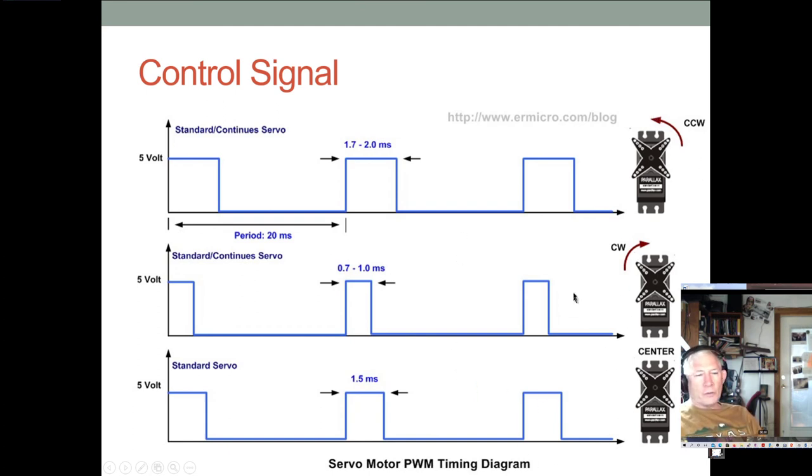You need to look at how your servo's moving, and you may realize that 75 makes it go too far down, and 225 makes it go too high up, and you may want to restrict those so you limit the travel of the servo to not overstress your tilt table arms. Some of the tilt tables have bigger tabs on them where I connected the push rods than I should have put. Some of these days I need to take all the tables off, saw those rods down shorter and redrill the holes, but I haven't done that yet. But one of these days I'll do that, and that'll make them a little bit nicer.